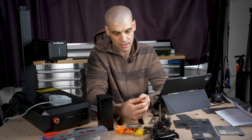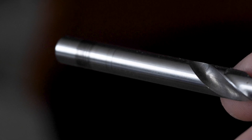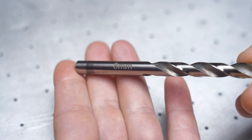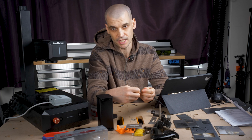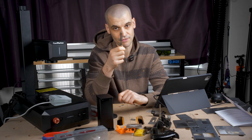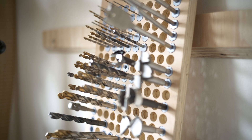Sticking with the tools, I wanted to mark some of my drill bits. I've got some Dormer drill bits here — very nice, but the markings on them are tiny and not very deep. They're difficult to read and do wear off over time in chucks. I've gone ahead and marked my own big text on this, and you can feel it's really eating into it — a really nice deep engraving that is not going to come off. I'm definitely going to be engraving all the diameters for these drill bits to make them much easier to read in my modular drill press holder.